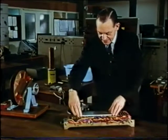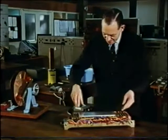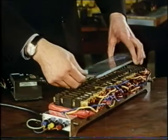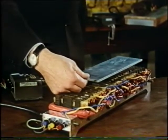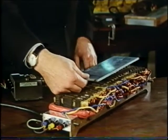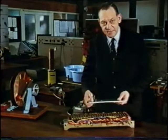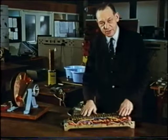Lay it on the surface and switch on. This time without switching off, I'm going to put the aluminium back and hold it with finger and thumb at one end, so that you can see that as well as the horizontal force, there's also a lifting force. When I let go, of course, it shoots off. This is the force we designed it to have. The lifting force is something, in this case, we really didn't bargain for. Now this is the linear induction motor.